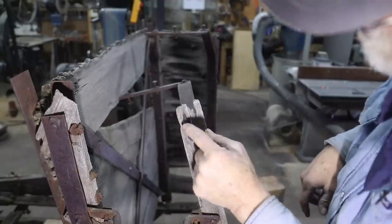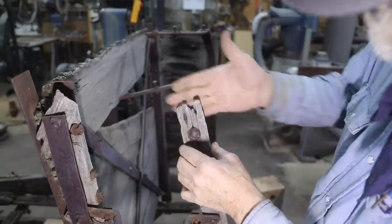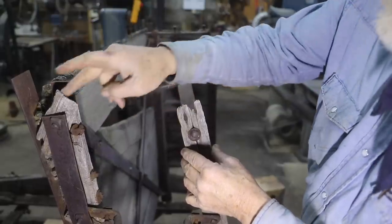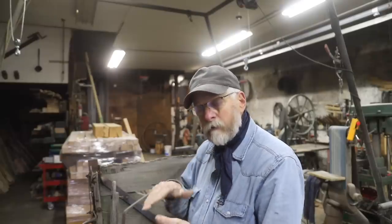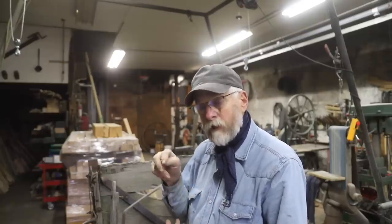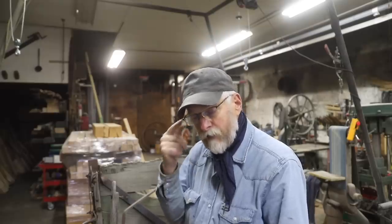And also you can see the remnants where there were 2 screws in this joint as it was jointed to the cross member from the front frame to the rear frame. But we need to go 1.5 inches down into the main frame, because I'm not just going to butt joint it on the top of the frame. I am going to mortise and tenon it down into it, and I'll show you how I think I have that figured out.